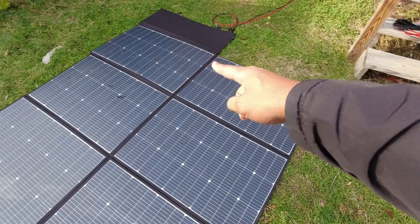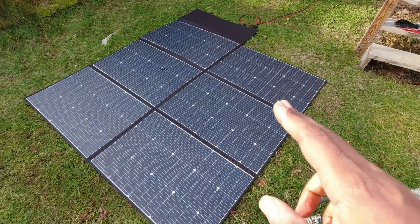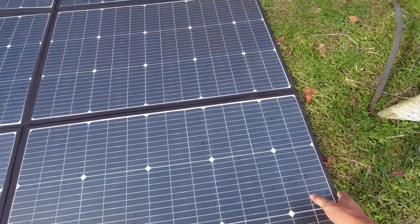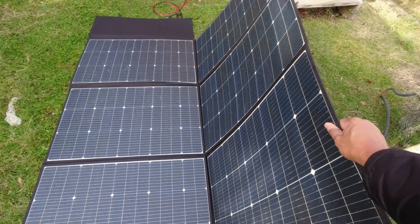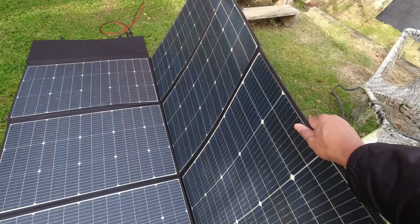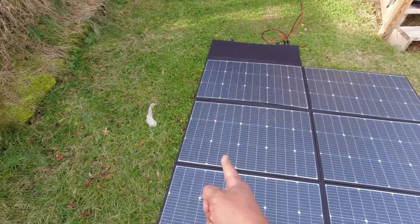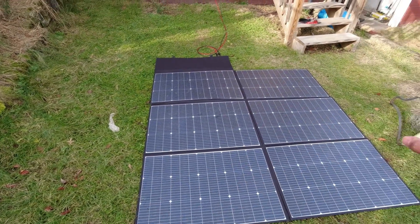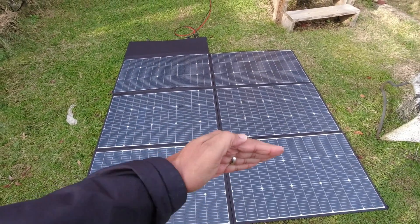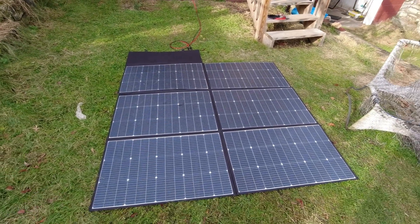What they did was split the panels — this panel and that panel are connected in series, which is strange. I had the automatic idea that I could set it up so one half leans up and catches more winter sun than the other half. But it just doesn't work that way because of the series wiring. As soon as you get shade on any part of a series string, that whole string is toast. In a vertical orientation, if shade comes up from the ground, two panels are out but the other four are still getting power.